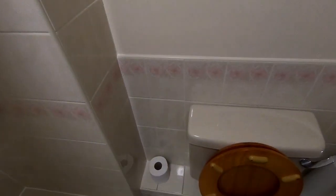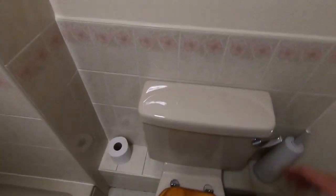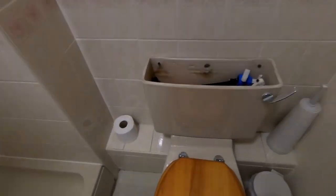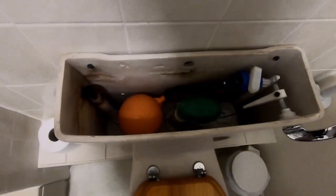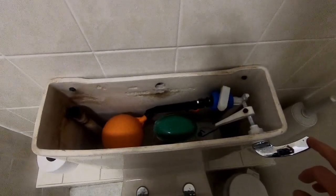What I've been told is that they're having to flush the handle a couple of times — pump the handle a couple of times. So initially I'm thinking possibly a siphon problem. If you have to pump the handle a few times, it's normally the diaphragm in the siphon. I'm going to give it a go and we'll see what happens.